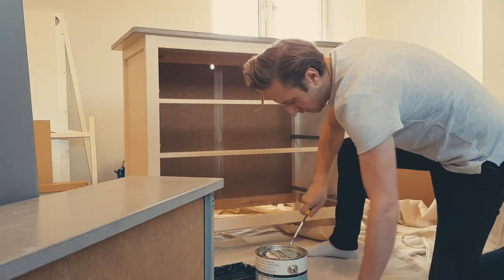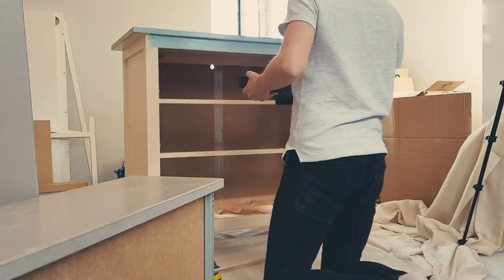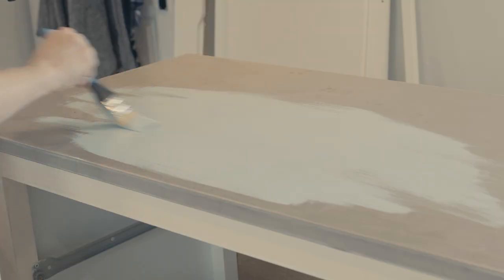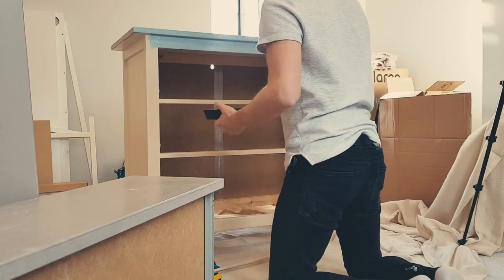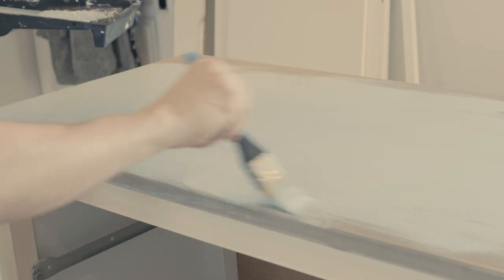Stage 2: Painting. To kick things off, open up the paint and be sure to mix it well before pouring it into your tray. Then it's just a case of working from top to bottom with careful brush strokes applied in the direction you would expect the wooden grain to go. For example, when painting the top I brushed left to right, but when working on the vertical corner parts I was brushing up and down. Just be sure not to leave too much paint in any spot, and keep checking back to ensure that you haven't, as you'll see that this starts to drip and solidify later, which is not what you want.